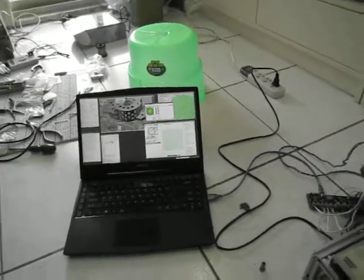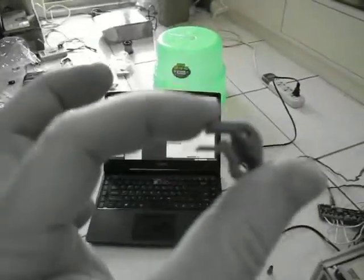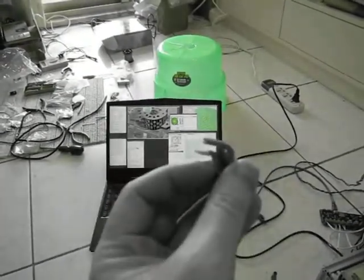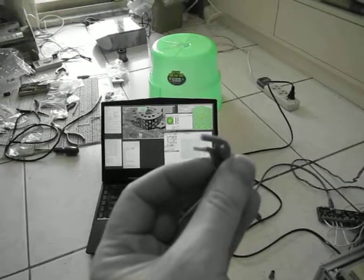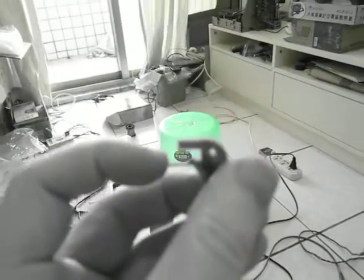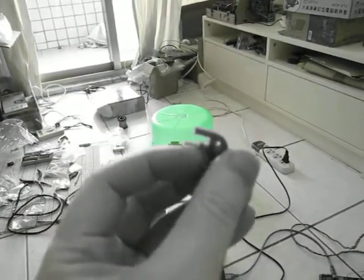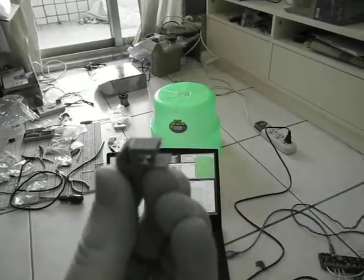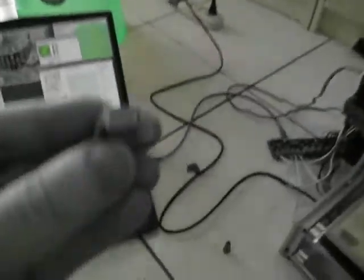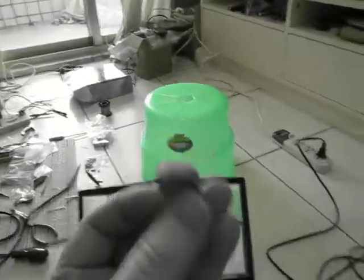With this $150 printer — right now, can you see just here? It is actually straight. That is level; there is no bulging on that corner. Now here's one I prepared earlier — sorry it's not clearly visible with this camera — but on the edge here you can see that's flat, but just on that corner it's bulging. That's down to the extra speed. Anyway, it's going now and we're doing the first layer.